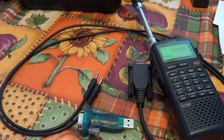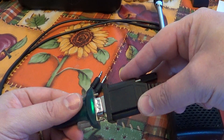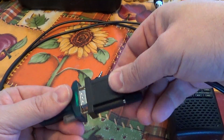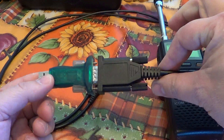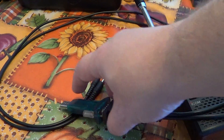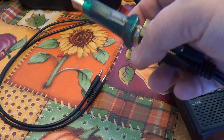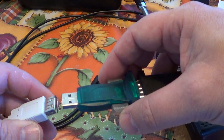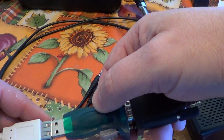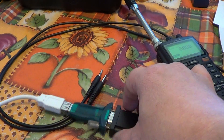To make it work, the first thing you'll need is a USB-to-serial adapter — a little electronic device that transforms the USB port into a COM port for serial communications. You use that adapter and hook it up to the end of your ICOM CIV cable. I personally prefer a longer cable, so I've hooked it up to a USB extension cord.